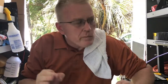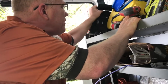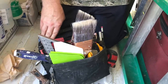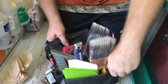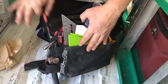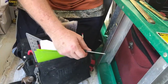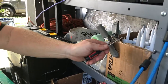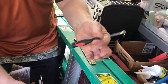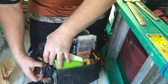For my individual tool pouch - what does a wallpaper hanger keep immediately accessible? You do not climb ladders with something that weighs 30 pounds or you'll wind up with back trouble. You want a hammer accessible. You want what I call dental tools on the job - sometimes with commercial vinyl you've got to pull it off. When you're at the top at the ceiling and can't get a bubble out, you do this to the wall covering.